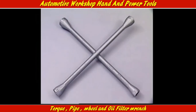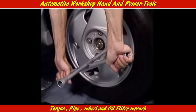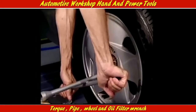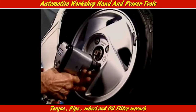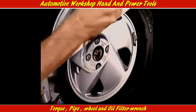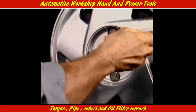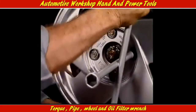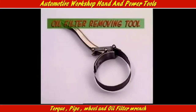A wheel brace is a specialized wrench. This model has 4 different sockets, one on each arm. Never hit or jump on a wheel brace when loosening wheel nuts. If the brace won't remove them, use an impact tool. When using the wheel brace, the force provided with your hands is adequate to secure the nuts properly.